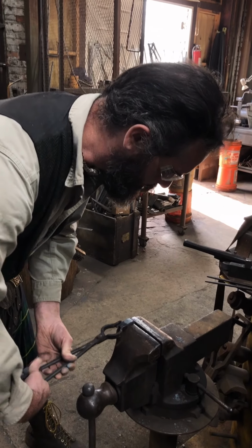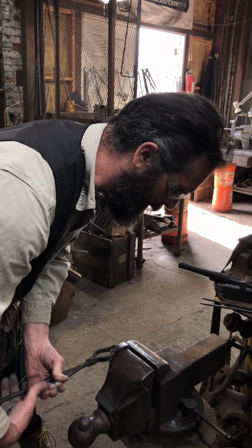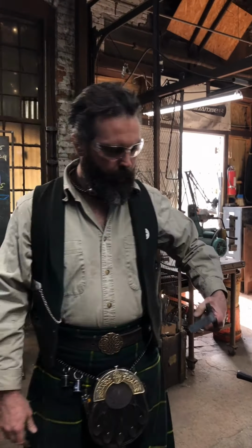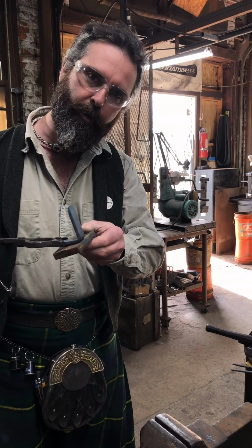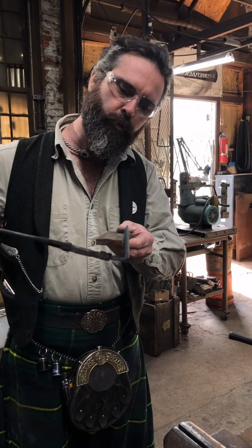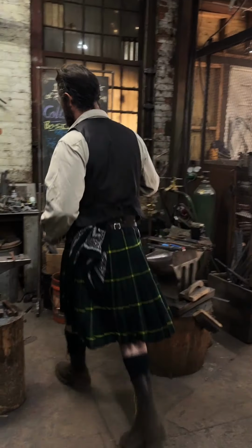Because my next position, this is kind of a whole bunch of really goofy basic jig setup. My next position, I want to be this way, with a block in it like that, but it also needs to be supported on the underside so that when I clamp it up, it doesn't drop down and I wind up with the fold in the wrong place. So I've now got to shim up a whole bunch of nonsense over here whilst this thing goes.